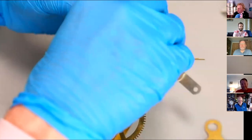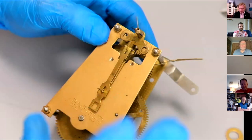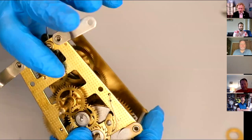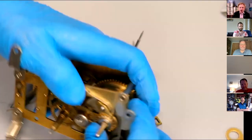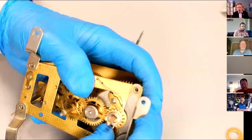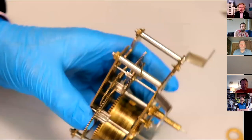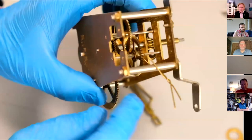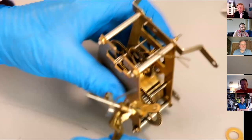Why don't you let the spring down first? The reason I don't let the power out of the wound up spring first is you have to hold the mechanism really firmly, because we don't want it to cause an accident. Particularly for a beginner, you're having to squeeze the clock and it might damage the mechanism. So that's the reason that I block the train. And you can see, even though there's power in this spring, the wheel can't rotate very fast. It can't run down.